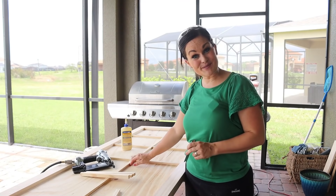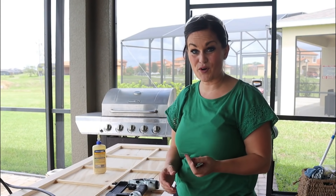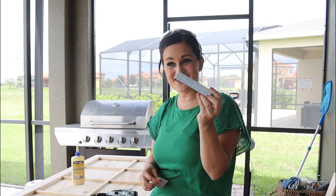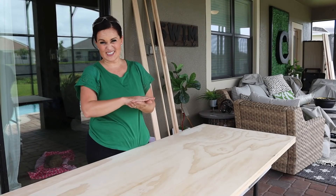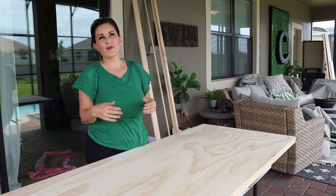I've made a pretty big boo-boo and I feel kind of dumb. Hopefully I'll be able to fix it. What happened is I measured these nails to the outside and they were perfect, but I didn't think about the fact that the grid trim is much thinner, so all the nails we just put in are poking through. I don't know if I'm going to clip those off or hammer them out. For the rest of them I do have shorter nails. Our beautiful pristine back is now going to need some putty — I'm super not happy about that. I messed up still. It's not flawless. I nailed them back out so it's kind of flush now. We're going with a rustic look anyway, and we're going to be doing a whitewash finish over the top of our stain, so hopefully you won't even notice.